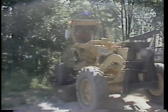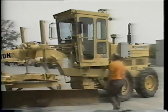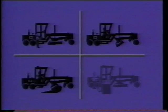This videotape will show the general methods and procedures for operator daily maintenance on motor graders, but more importantly, it tells you why these procedures are necessary. By using a checkoff list, the operator can divide his checks into four groups of activities: the pre-start check, the warm-up check, the daily operating check, and the shutdown check. If during these activities problems are discovered, follow your local guidelines to determine corrective procedures.